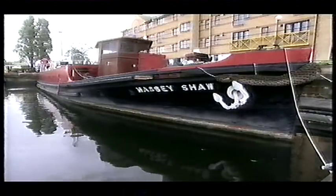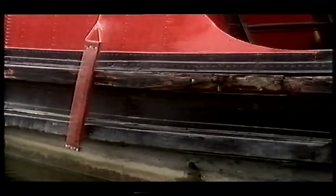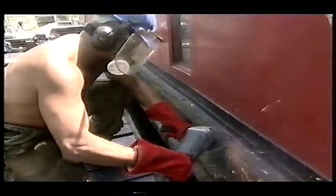They're massive lumps of wood — four-inch thick oak, a wood not famous for being bendy until it gets steamed up. What the steaming process does is soften the wood to a point where it's more like a large lump of rubber. Then the theory is that you can clamp it into position and once it's cooled it'll hold that shape.